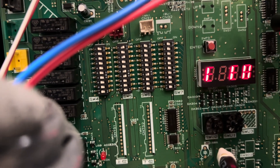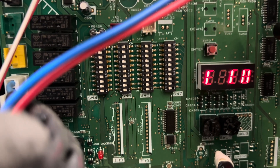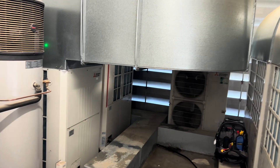So SW6 — I'll put up a screen grab — but SW6-4 and SW6-5, both being off means the static pressure setting for the fan has not been changed. If it hasn't been changed on this system, do you reckon it's been changed on that one? Not a chance. And even these ones here, the duct is coming straight out and then being pushed straight back down — that's adding another restriction. This is crazy.